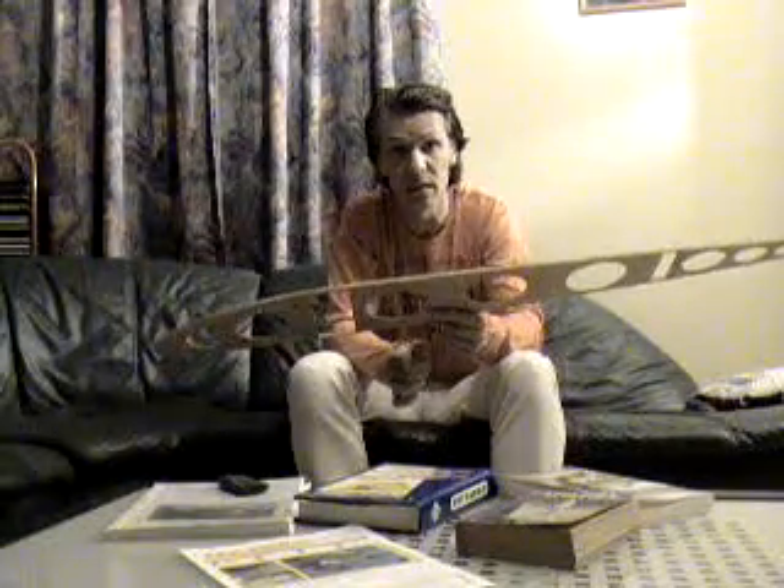You feel the wing lifting in your stick. Now you would say, that's a bad thing — always having to pull. It's very bad. No, it has two advantages. One is that if you come close to a possible stall, you can feel it. Because the wing doesn't have any lift, and you feel that you no longer need to pull. So if you get close to a situation like that, you can say: OK, I push a little bit, or I give a bit more power. Easy done.